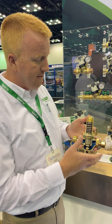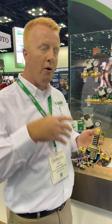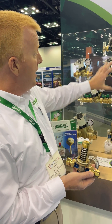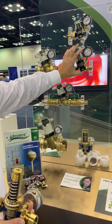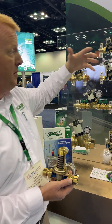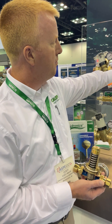It's also a great valve for a first stage PRV application. So if you get those applications where you've got really high incoming pressure — say 200 plus PSI — that's not a good application for your standard diaphragm type valves, because going from 200 down to say 60 is a pretty big ratio, and it's going to lead to a lot of squealing and a lot of premature failures in these diaphragm styles.